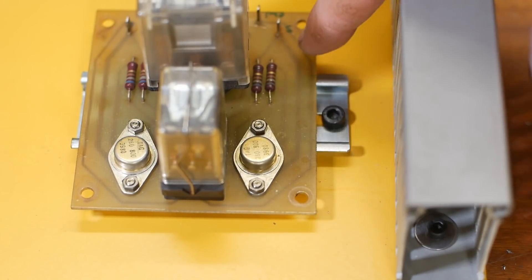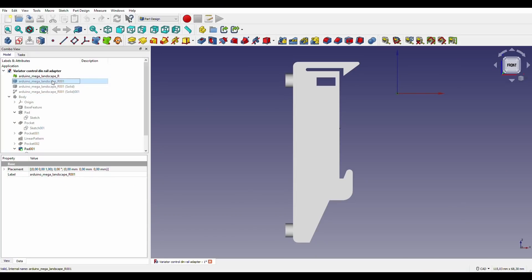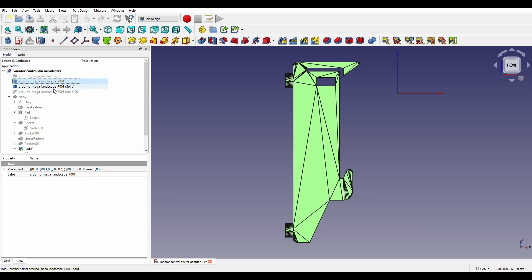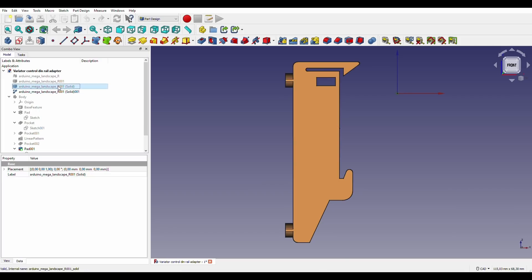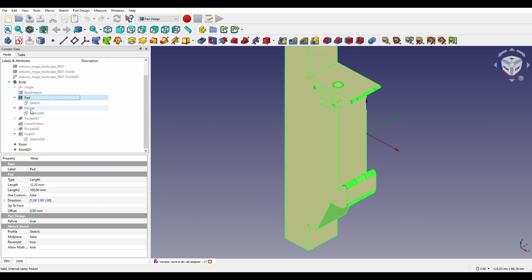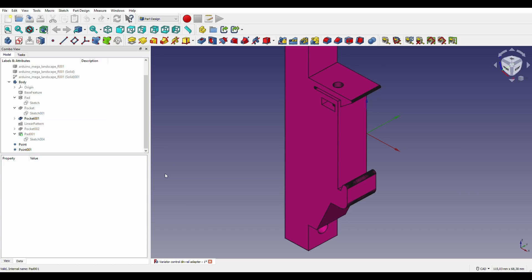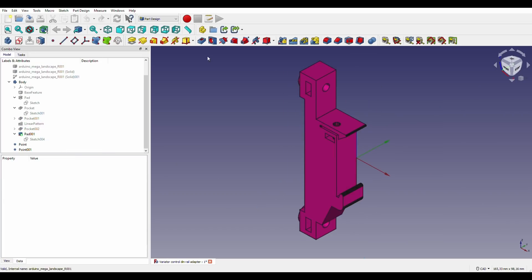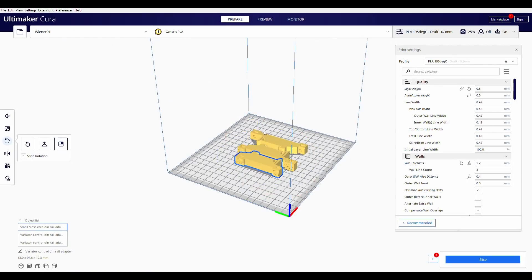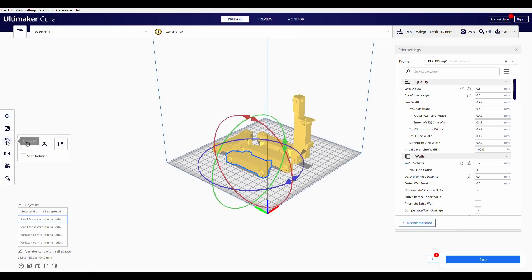I need to design an adapter to 3D print to hold this onto the DIN rail. So I picked up a DIN rail model off Thingiverse, converted the mesh to surfaces, then converted the surfaces to solids, and finally used the Simplify tool to make it a normal looking solid. FreeCAD is actually pretty good for this. After that I added the various features needed to mount the different boards, then exported the model back out as an STL file. I used Cura as a slicer. I had to sort out the orientation because the parts came out of the STL export with the wrong orientation, but that's easy to fix.